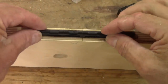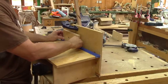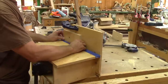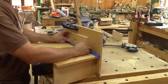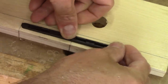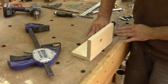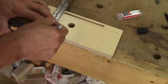The male part of the joint can go here. Now, without changing anything to the setup, you can cut the groove on the other piece. The only thing different is that I added tape to see where the bit starts and finishes. Here it is, the second part of the assembly is done. All this will go together just like that. But this is fine if you want the pieces to meet at a corner. I'll do another one with the groove not on the side.